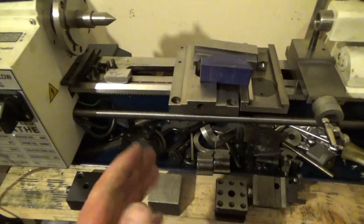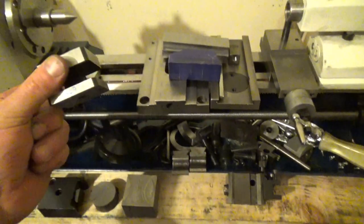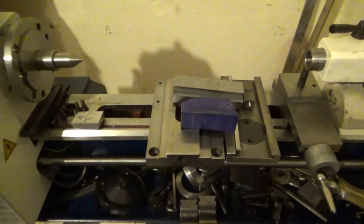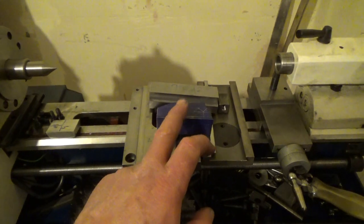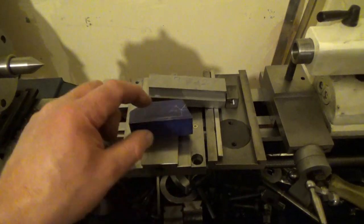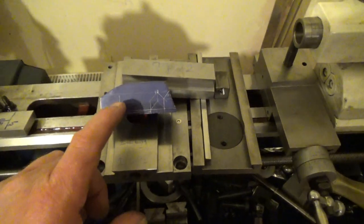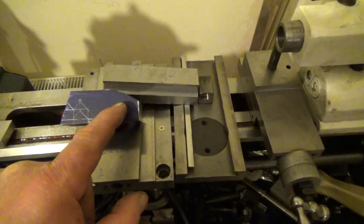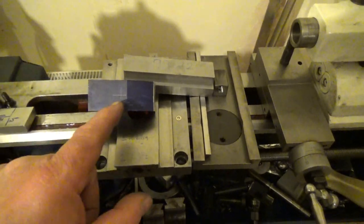I might also put one on the saddle because the one that moves with the saddle on the Holbrook is really useful. I may duplicate the steady rest holes and put a couple of holes here for another steel block — not only to protect from chips near the handwheel during manual turning, but also as a place to put a mag base for DTI work without having to set up on a tool post holder. There are two deflection shields planned. There's a 60-degree angle, a 45-45 with a 50-degree cut, a hole for the carriage stop lock bolt, and the clamping bolt position.